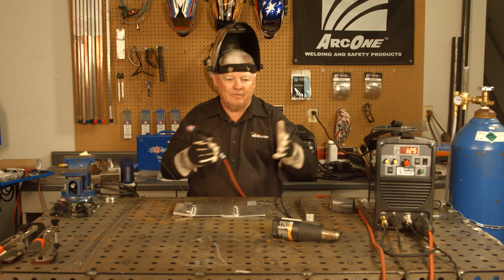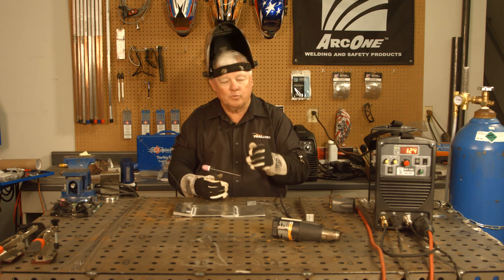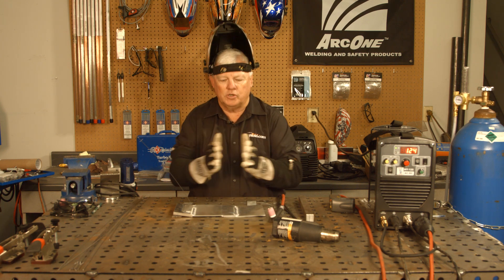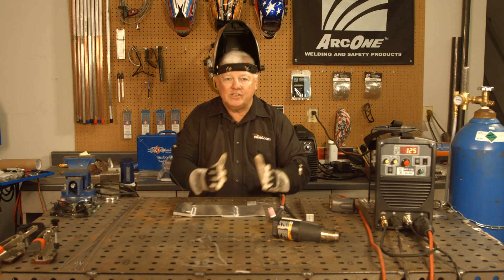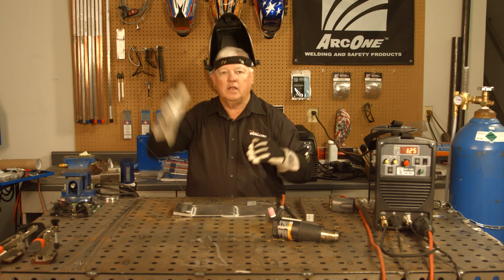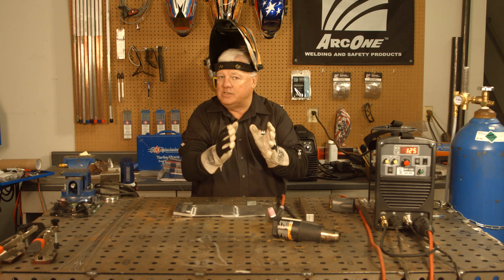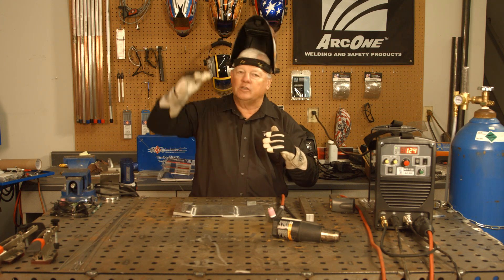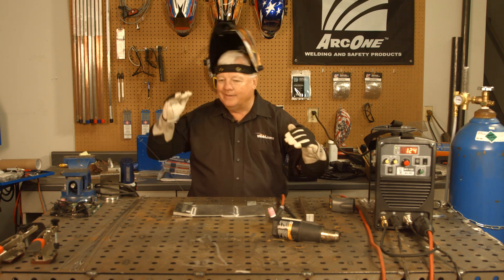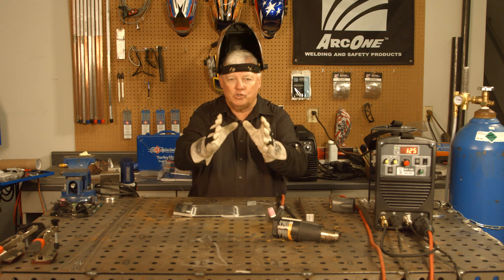It's very uncommon to have a machine that only has so many amps — this machine will give you about 125 amps. When you go to buy a welding machine to do aluminum, you've got to have an AC/DC machine if you really want to do it right. The smallest machines you see — this is one of the smallest in the AC/DC category. Then you get the monsters up there — they're AC/DC but they're 375 to 400 amps, so the price goes along with it. Pick a machine that matches your needs — you don't need to overkill by more than 10 or 20%.